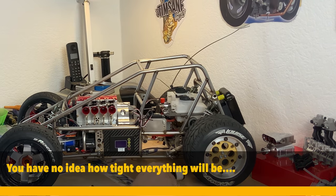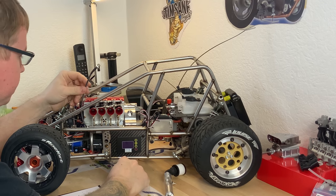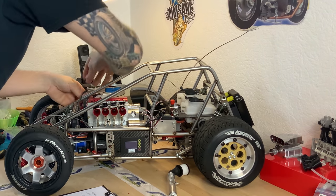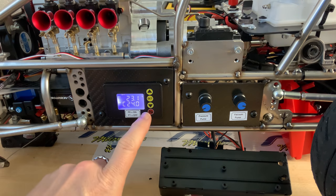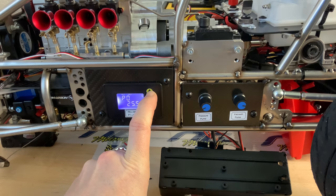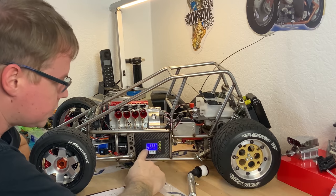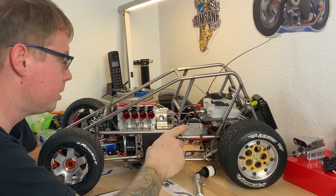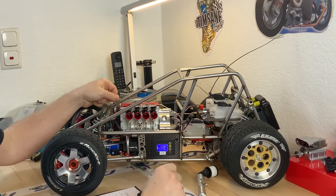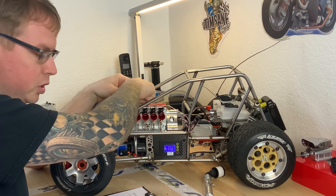This will be mounted in this area roughly. We have this controller box and a temperature sensor that goes directly on the other side of the cylinder head, so I have direct control over the cylinder head temperature at all times. Let me power the system — the car has two power circuits. You can hear the first fan already running. There's a switch in there — I don't want my fingers cut off. You see this thing lights up once I power the car. This controller manages the whole fan system.